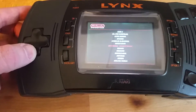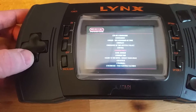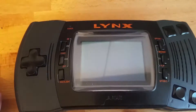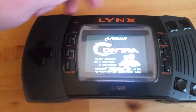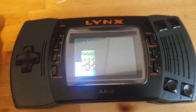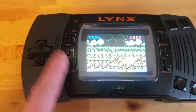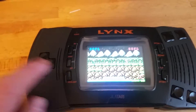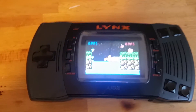Let's just go ahead and find something to play here — there's a lot of stuff on this one. It goes ahead and boots up the ROM. I've mapped the A and B buttons; X and Y have been mapped to option one and flip, and start is option two. Select is the backlight button, and the off button I've actually wired up and written some scripts so that if you hold it down for three seconds it'll do a safe shutdown on the Raspberry Pi, which is important so you don't corrupt your card.